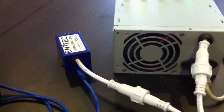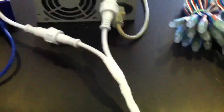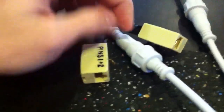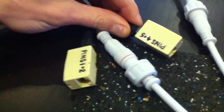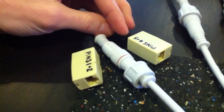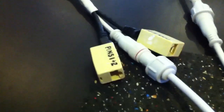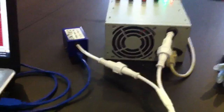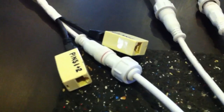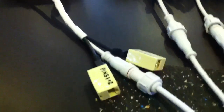So that runs out here into basically just a splitter. This has two male inputs — one for DMX data and one for 12-volt power. You can see here's my power supply. Those two wires come together and output into a single male connector. I also put two adapters on here for Cat5 cables — this one runs on pins 4 and 5, which is the standard LOR D-Lite pinout, and this one runs on pins 1 and 2. So I can take my existing setup and plug it into any of the other things I'm using through this injector.